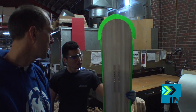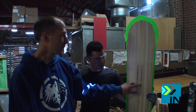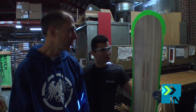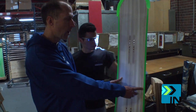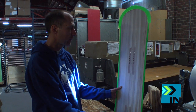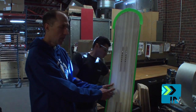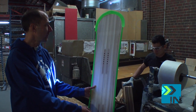We use a few different kinds of wood in our boards. You can see this would be the top of the core. We have birch in the insert area — that hard wood for a solid connection underfoot keeps the bindings from pulling out of the base. And then we've modified the core block with poplar, a harder wood over the edge of the board, for bite into harder snow and added durability.